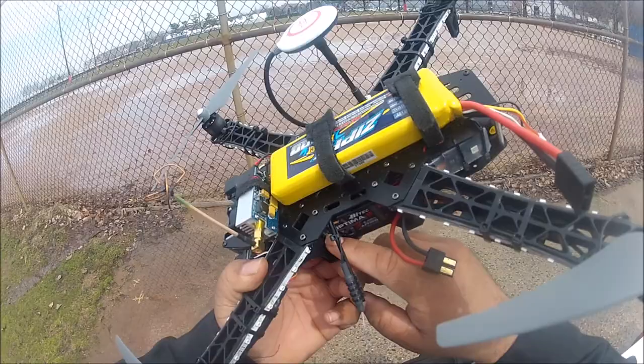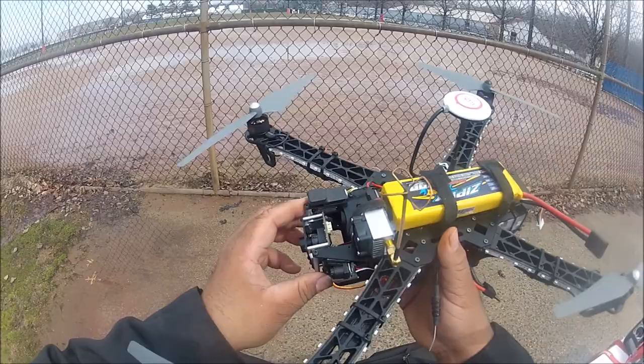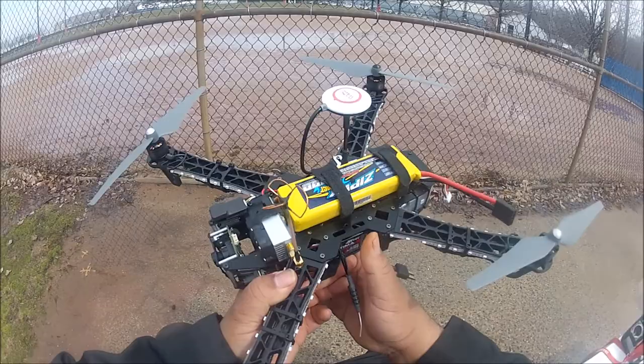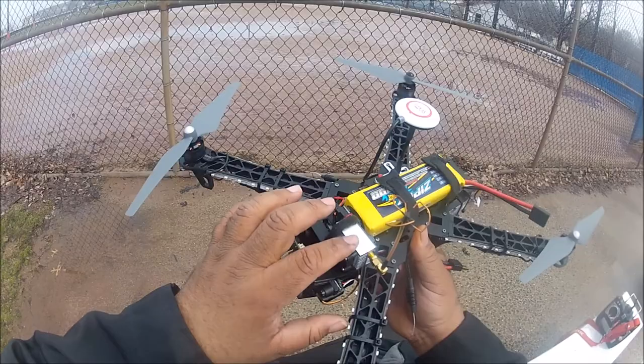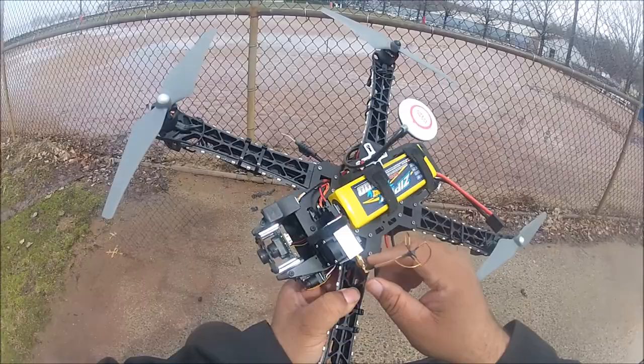I have a small loss alarm here that I can also switch on and off from the radio — useful if I land in tall grass or somewhere hard to find. As long as the battery doesn't disconnect, I can trigger this loud alarm, which is about as loud as a smoke alarm in your kitchen. For the video transmitter, since I'm using Foxtech video goggles, I have a Foxtech 1000mW mini video transmitter at 5.8GHz with a cloverleaf antenna — the cloverleaf is from Quad Frames and is made in Poland.